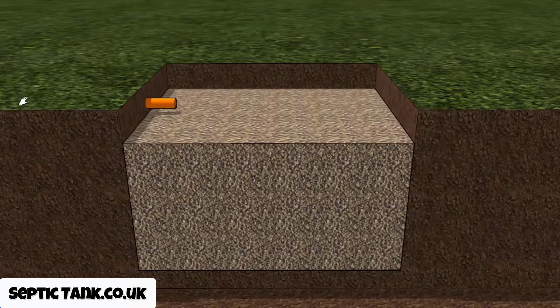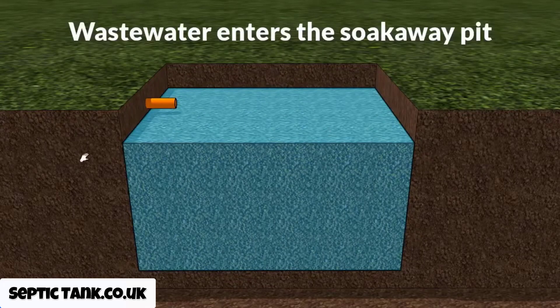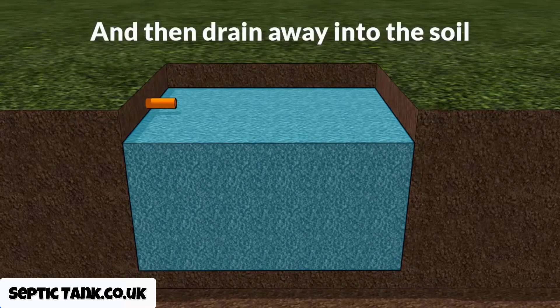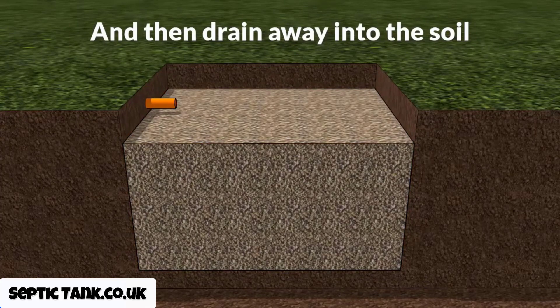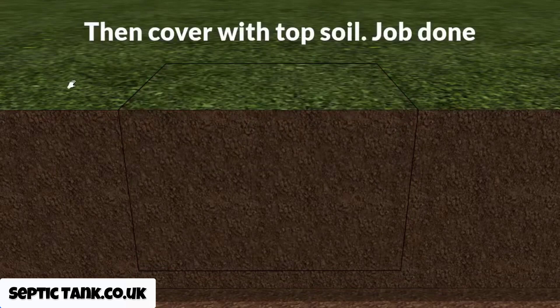So how does this work? Once the cube septic tank fills up with liquid, the waste water will leave the tank, come down the outlet pipe, and make its way into the soak away pit. It will fill up all the spaces between the gravel, and then naturally drain away into the soil surrounding the soak away pit, like so. That's why they very rarely go wrong — it's a very simple design and construction, but it works extremely well. Once you've done that, just cover everything over with topsoil — job done.